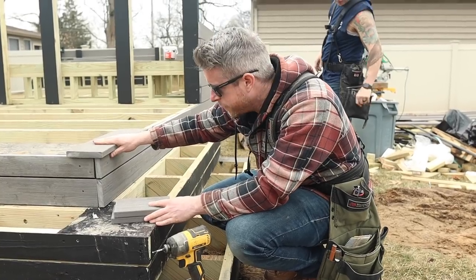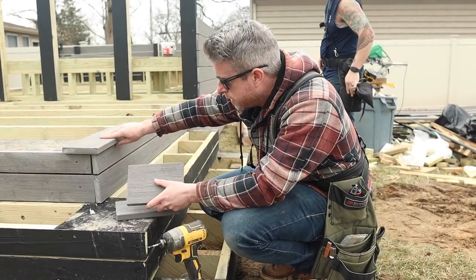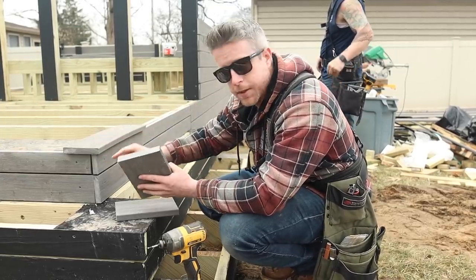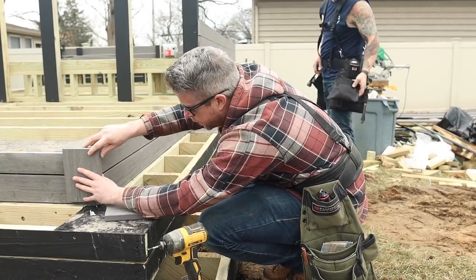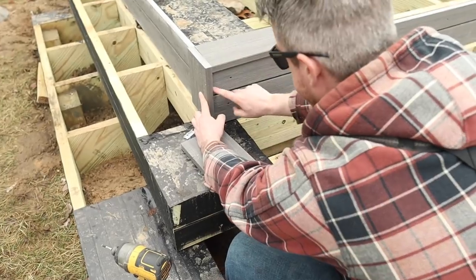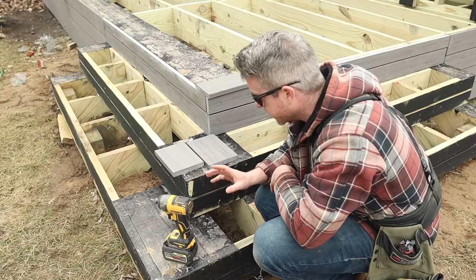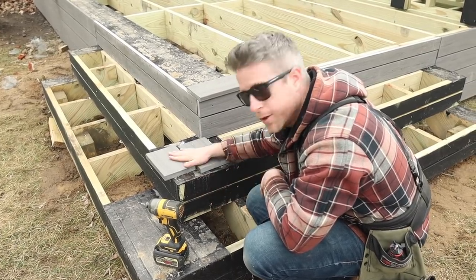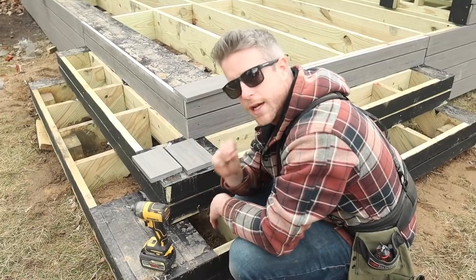Basically what we're gonna have here for this step detail and border detail is our border piece on the deck coming over like this. This will be mitered, and it'll come down, folding over the edge. We're gonna be nice and tight here. This will have a nice miter on it, it'll fold right down. I think it's gonna look really sweet, especially with that drone pic, and we're gonna do the same thing on the bar actually. So it's all gonna tie together. I think it's gonna be a really nice little detail.